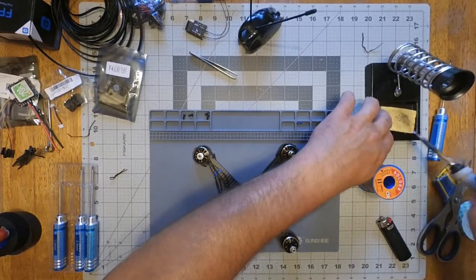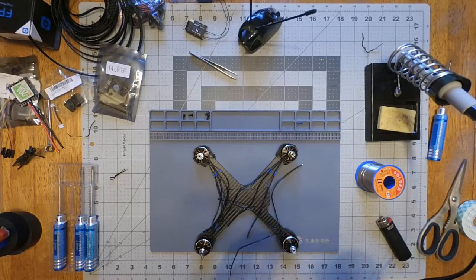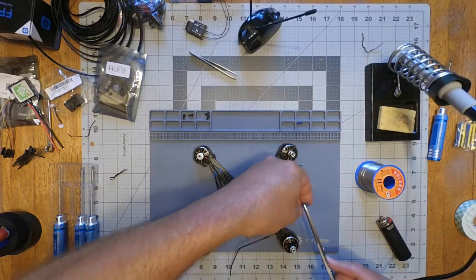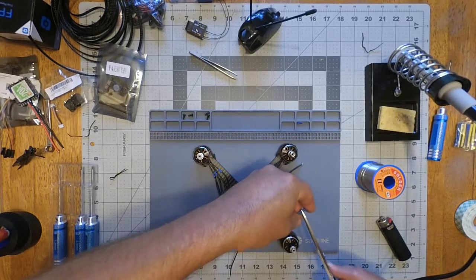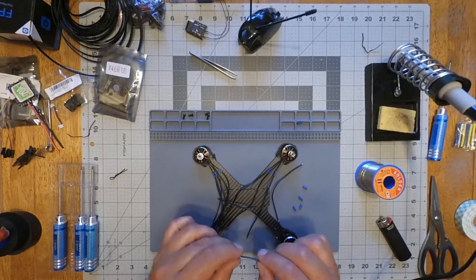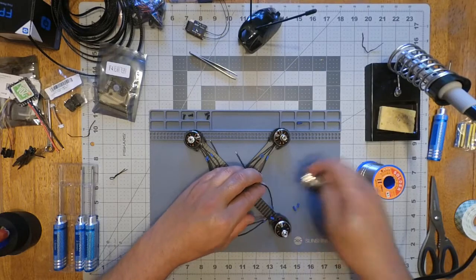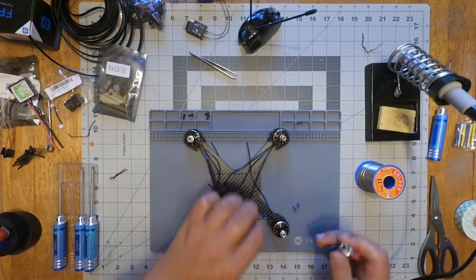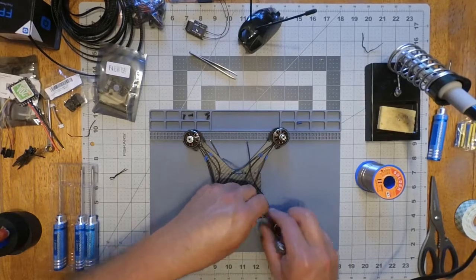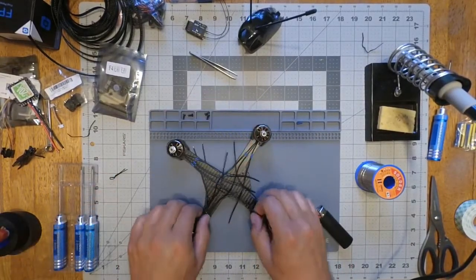When you're soldering these on, when you pull away you leave a little sharp point — so you can just glance the iron back over it and it'll melt it right off, so there's no sharp part that could poke through your heat shrink. You don't want it shorting on the carbon fiber. I don't have any black heat shrink left so I'm using blue — it'll be hidden inside the sheathing so it's not too visible. Then put on the heat shrink; I'll probably do two layers just to be safe.